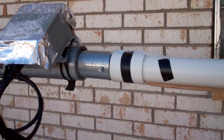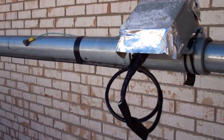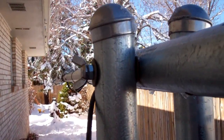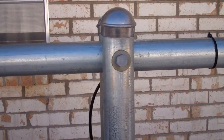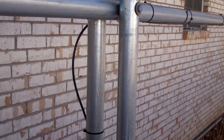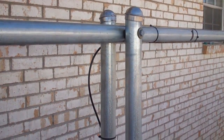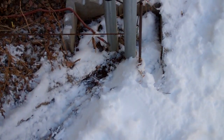From the junction box where the antenna comes into the mast, the mast is 13 feet of heavy gauge fence posting — a 3-inch fence post. It comes down to the pivot point, which is a half-inch bolt on one side with a wing nut for ease of removal. The mast pivots about 6 feet off the ground and is attached by the pivot bolt to two more heavy gauge fencing posts — a 3.5-inch galvanized fencing post for the base, which extends about 6 feet off the ground and goes about 3 feet into the ground.